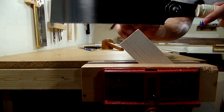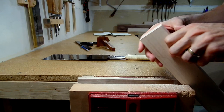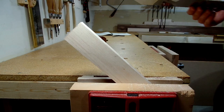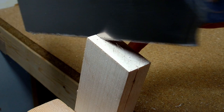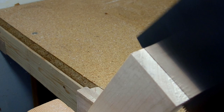I start by cutting from one corner, making sure to follow my line across the top and down the side. When I get about halfway I flip the piece over and do the same on the other side until the two cut lines meet. The cut is established at this point, and now all I have to do is follow my line at an angle for a little way on one side, flip the piece over and do the same on the other until I reach the other end. I found it can be tempting to cut really far down one side to save the trouble of flipping frequently — however, when I do that I usually end up getting off my line on the other side. So as time consuming as it is, I try to flip the board back and forth as much as possible. When I make it down to the other side, I flip the whole piece over and follow the same process, cutting from a corner and following my lines, going halfway, flipping the board over, and cutting from the other half, meeting in the middle. I keep sawing to my lines until the cut lines meet and the boards break free.